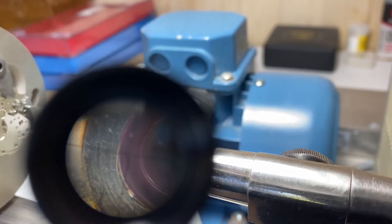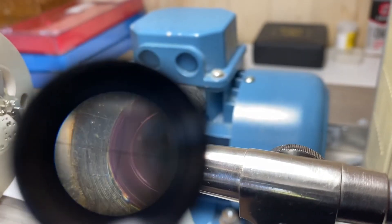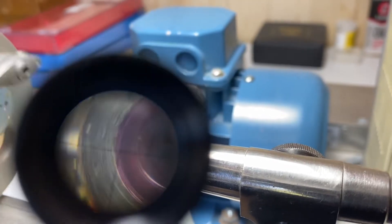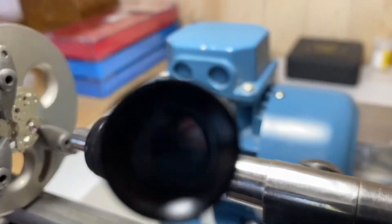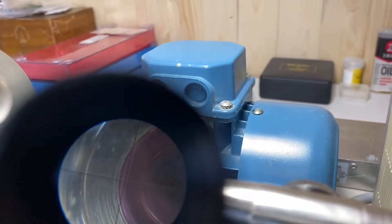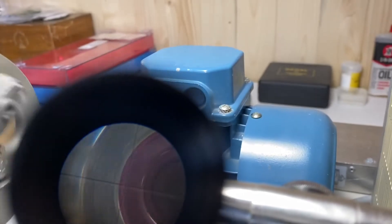So what we need to do is tap the work piece with a wooden mallet to find center. If you just drilled now — if you took the plate off and drilled through the bridge — what would happen? You'd have a completely skew barrel and a completely skew hole. So we can now look and see. What I'll do is tap the work piece true and then we can come back and have a look. Progress report — let's have a look and see where we're at. We're close.